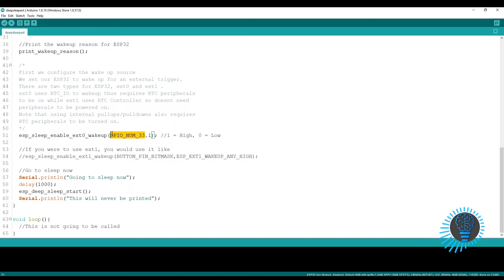We are using GPIO33 for external wake-up — you can use any other pin. Whenever it detects HIGH on GPIO33, it will wake up the ESP32 from deep sleep. After configuring the wake-up methodology, we put the ESP32 in deep sleep mode. I hope you have understood the program structure: in every wake-up methodology, you first declare the wake-up methodology and then start the deep sleep.